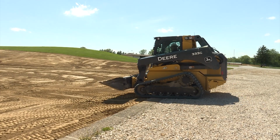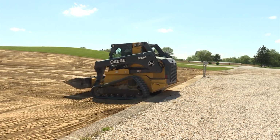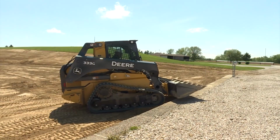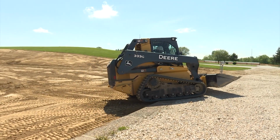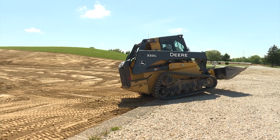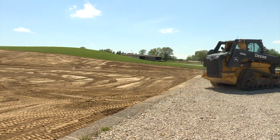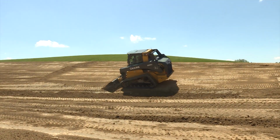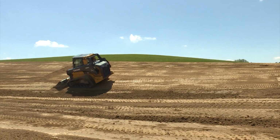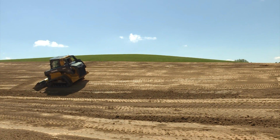Anytime that there is a significant amount of track off the ground, go slowly to minimize the impact after the breakover point is reached. When operating a compact track loader, cross over obstructions at an angle. Ease up to the breakover point. Balance slowly on the obstruction and ease down to minimize the impact. On gradual slopes, work parallel to the slope. The dirt will fall to the lower side of the slope in a windrow. This will help hold the compact track loader from sliding down.